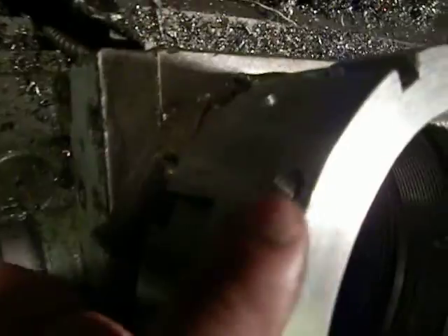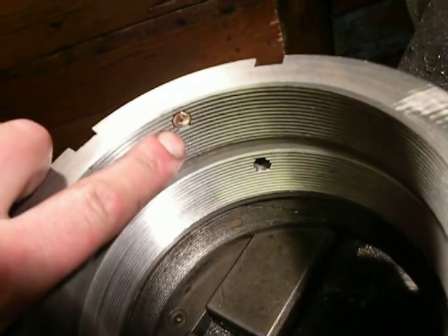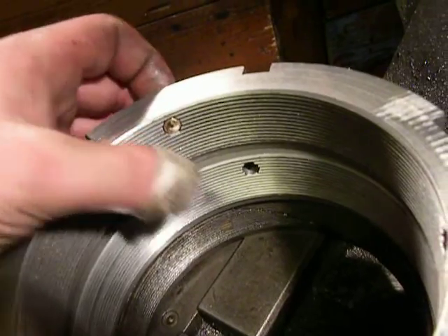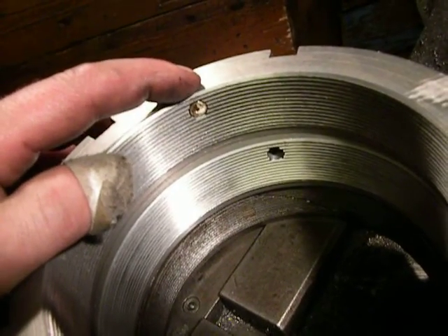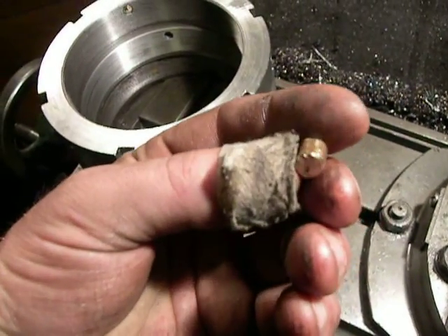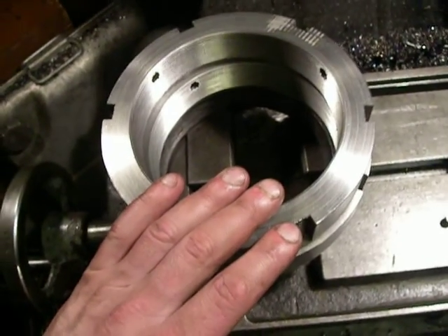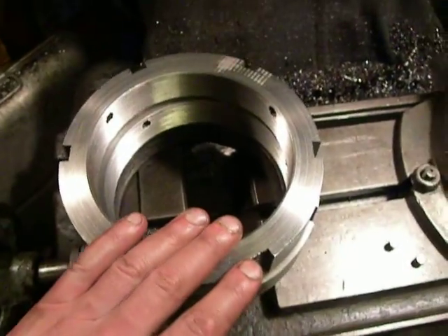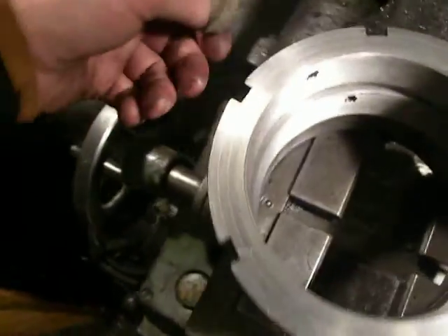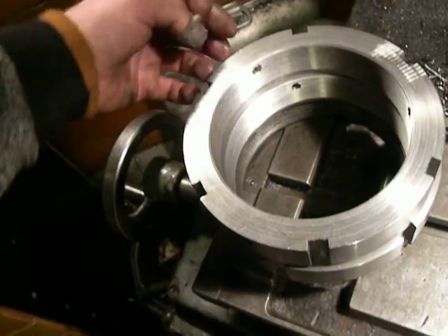What I figured out is: if we put a bore with a thread here, we can set a top screw there. From inside, we set into the bore a small part of bronze — or better, brass. When we tighten the nut and want to prevent it from unscrewing, we can tighten it with an additional top screw from the side.